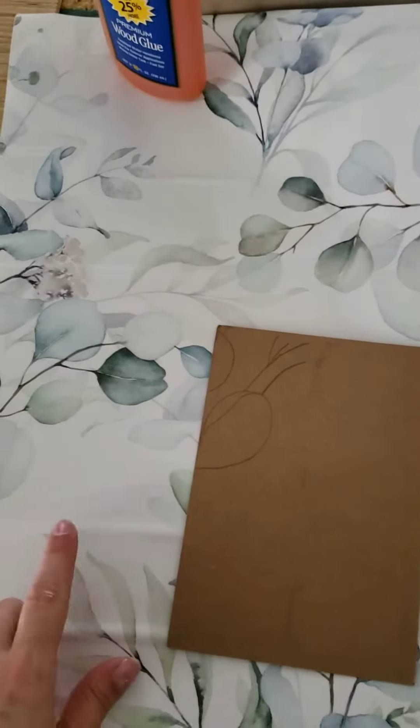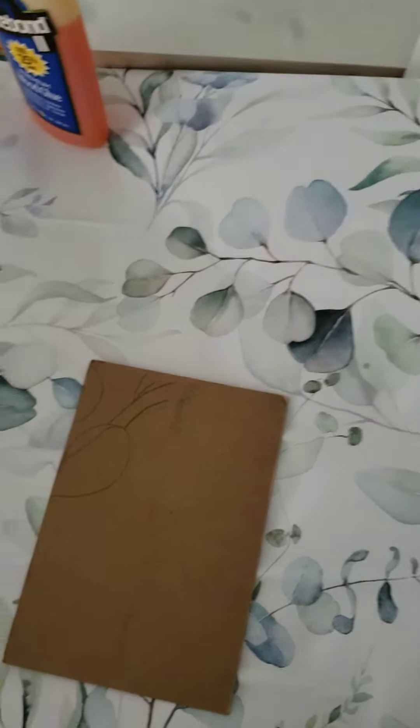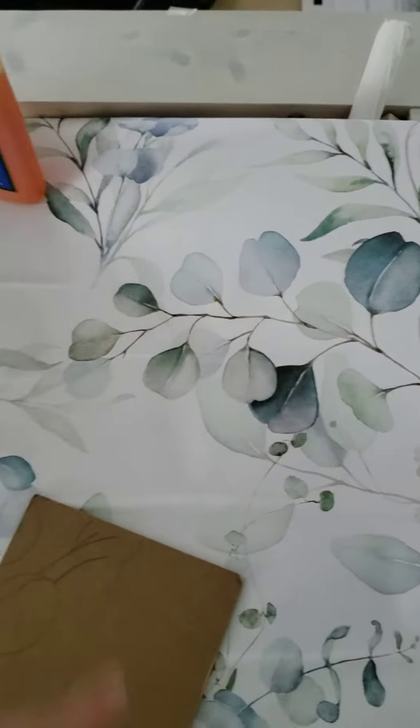One of the things I didn't think about when I bought my wallpaper was that the pattern could be really limited, even though it shows really wide in the pictures. When you actually put it up in a small space, you have to be able to align the left side with the right side perfectly, because the pattern actually goes left to right, not up to down.